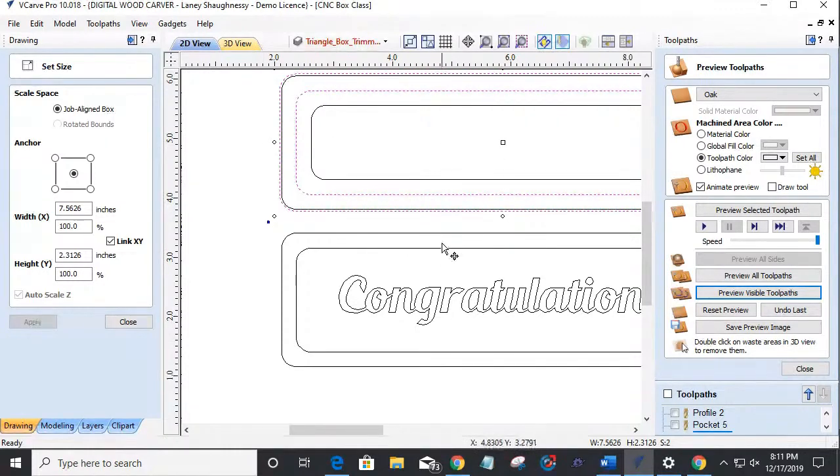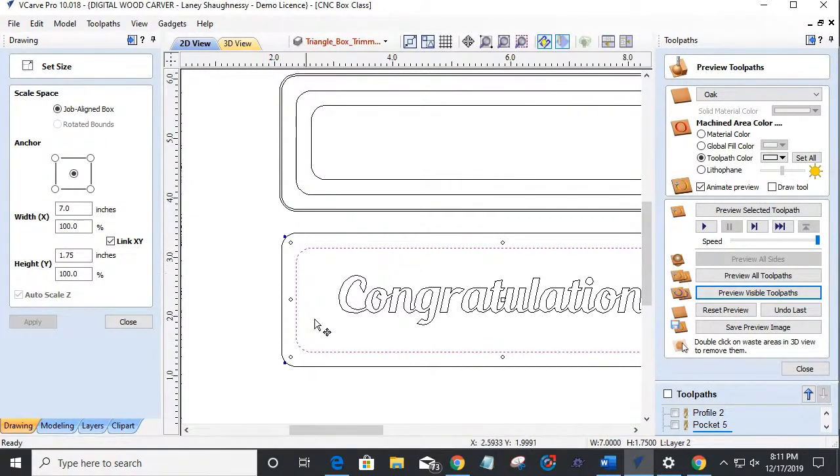When you're creating your tool paths, for the inside pocket of the lid, you give yourself a negative allowance. Give yourself a small amount. Depending on your CNC, that allowance may vary, but start out small. You can always sneak up on it, okay? So I usually use negative 0.005 as my allowance. And with that, I generally don't have to go any more than that.